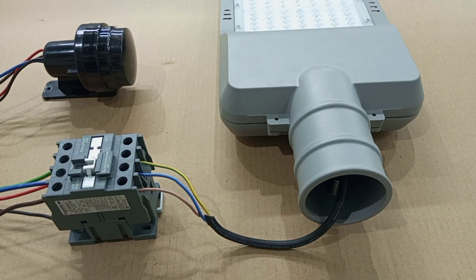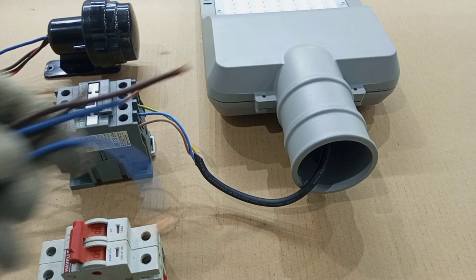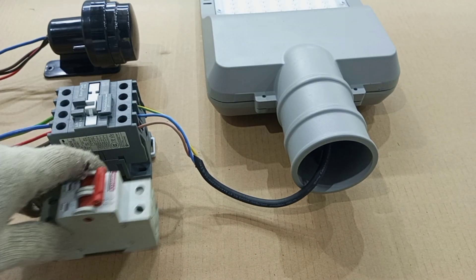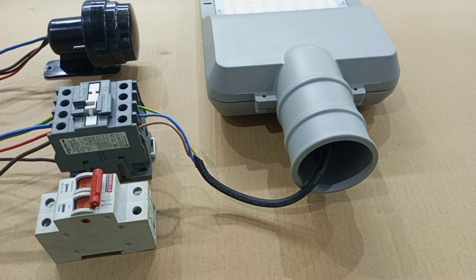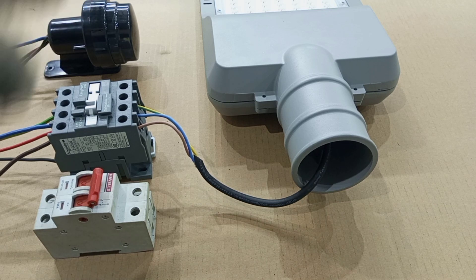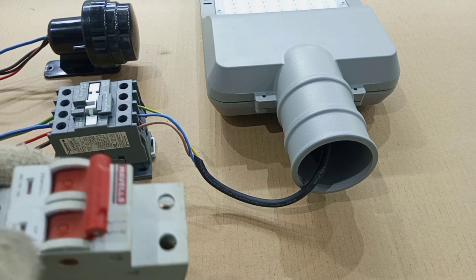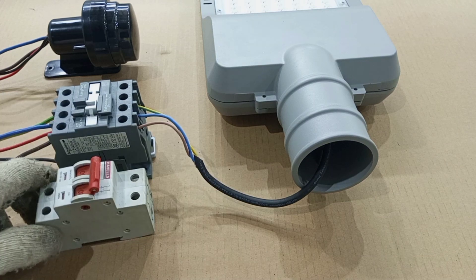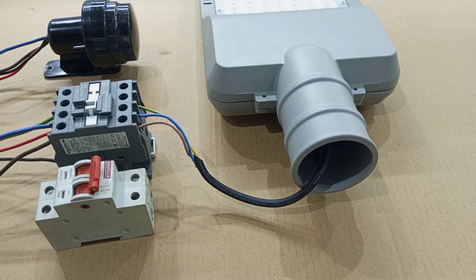So to do the bypass, we'll need a switch and some pieces of cable. This bypass system is going to be a permanent part of the system, but it will only be activated when we want to ignore the photosensor. We assume that in this system we will have many lamps connected, so the load demand will be quite large. When selecting the switch for the bypass, the switch must be selected so that it can safely carry the load current.